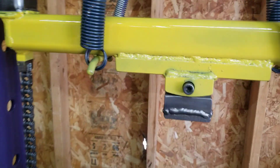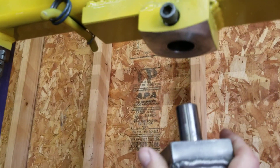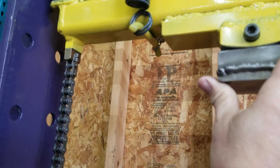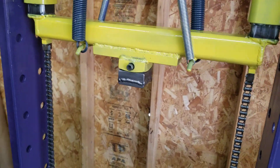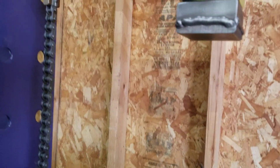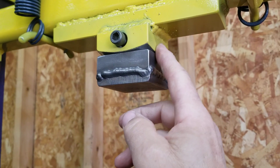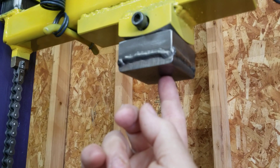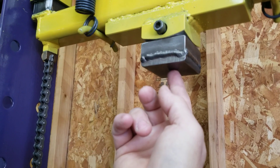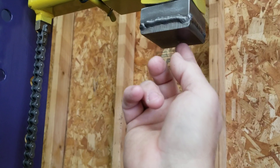Another thing I incorporated into the hammer part, much like Colson's video, is a round hole for the receiver part, and that allows me to use any of my tooling made for the fly press - it's completely interchangeable. This one here is made specifically for this: a piece of cold-roll steel on a one-inch shaft welded together, then a piece of leaf spring that I annealed and welded together. That should give me the toughness I need to constantly drive punches, flatters, my touch mark, and all that without beating up my other tools.